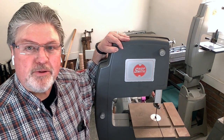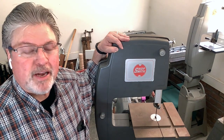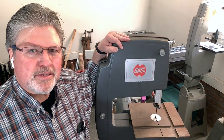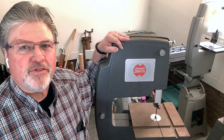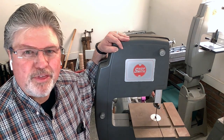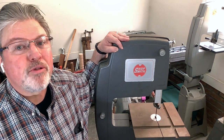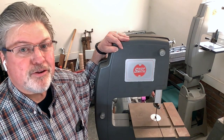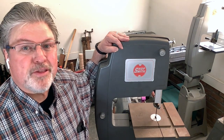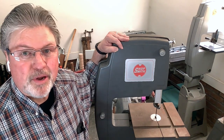If you don't own this cast iron table, you might want to watch this anyway — there are still some techniques that apply to pretty much any bandsaw. And if you're inclined to type a comment saying you've seen videos that say bandsaw blade drifting is a myth: we're talking about a Shopsmith bandsaw. Shopsmith bandsaws are totally different animals — there's no way to tilt the wheels, the wheels aren't crowned, the blade doesn't run in the center of the wheel. They're different, and the blade does drift.